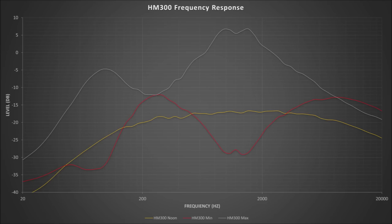With the low and mid control set to noon, or roughly noon, keeping in mind manufacturing tolerances, the output frequency response is mostly flat, with a little bit of attenuation on those hi-fi frequencies below like 200 hertz and 3,000-4,000 hertz. It's a decent blank slate for a boost pedal, because you kind of want that anyway if you're adding dirt to a signal, but it's kind of flat and boring. Now, things get interesting when you start to mess with these low and mid controls.